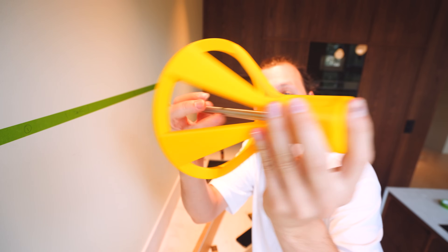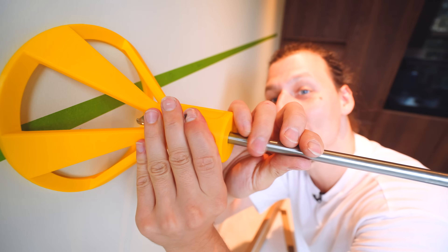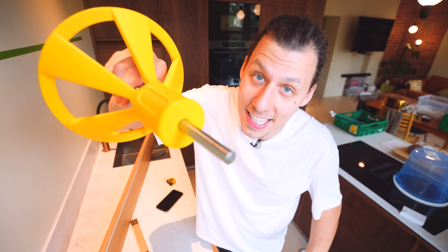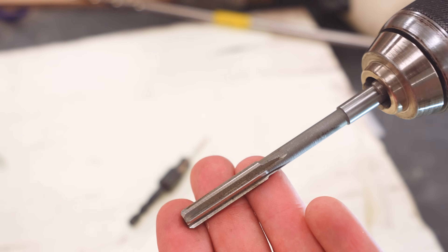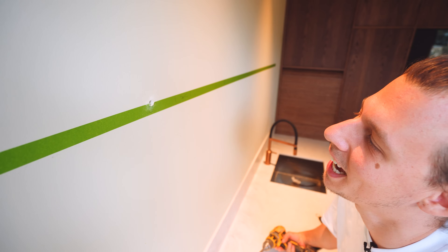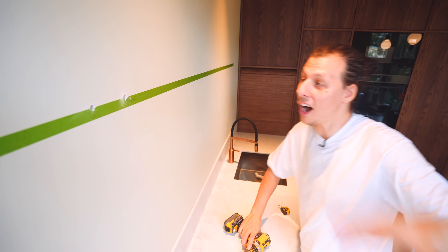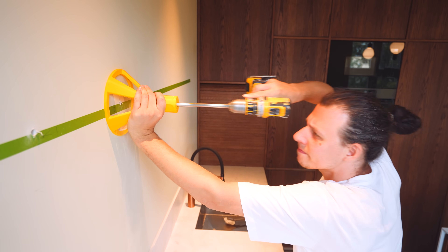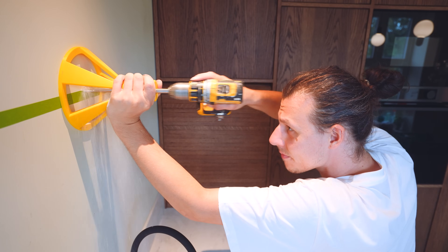This large thing is essentially just a drill guide. It has a hole in the back into which a long drill bit fits. You put the whole thing up against the wall, and when you drill in, you're sure the drill goes perfectly straight into the wall. A great tip for 3D printed parts like this is to print a hole slightly undersized and then use a cheap reamer to ream out the holes to a precise fit. The first hole went straight into a metal stud — I really tried my best not to find any studs. We'll just drill some holes in a different place. Because that's the beauty of this method — we'll later transfer these holes onto our shelf, so we don't need to be super precise. The only things that matter are that they're all the same height and that they're straight into the wall.